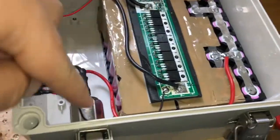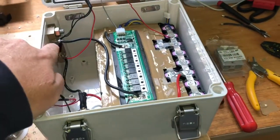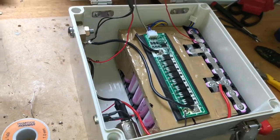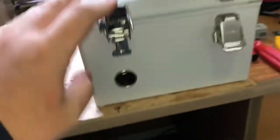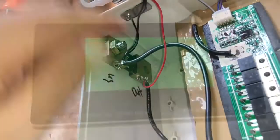The 60-amp BMS positive goes straight to the 12-volt output. Charger input goes straight to the positive. Battery goes straight into the BMS and then out of the BMS into the shunt, so there's no way the battery can be used without it being protected. Under here is where I've got the cigarette lighter plug. On the side I just used a bolt to hold the shunt in place.